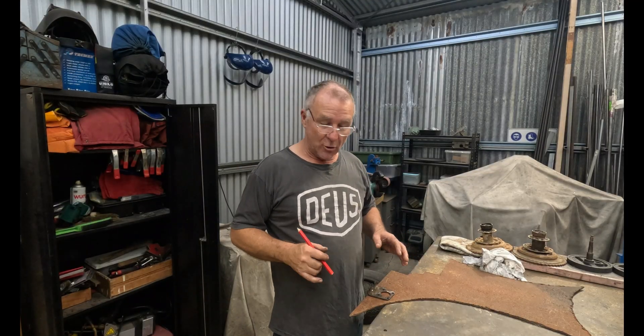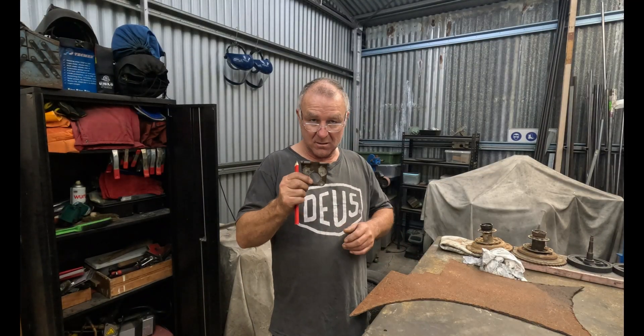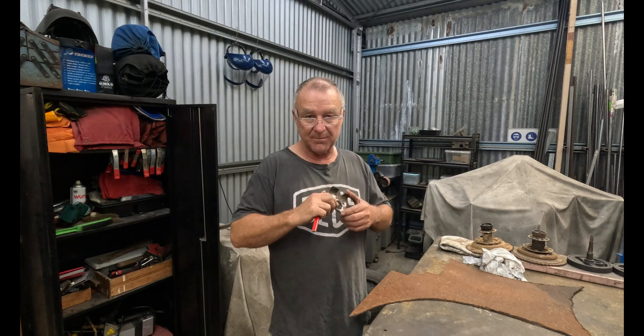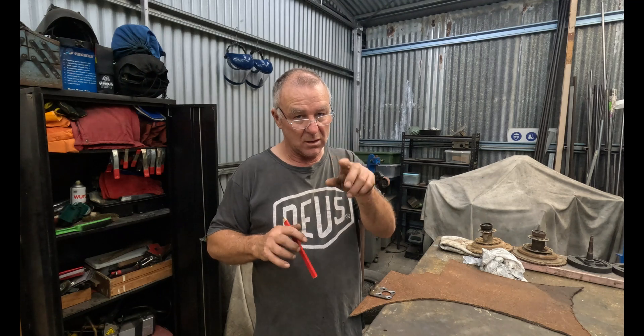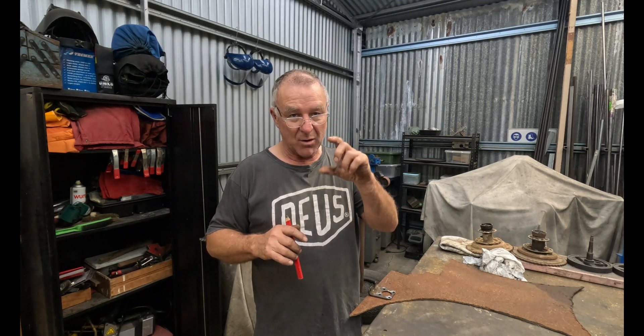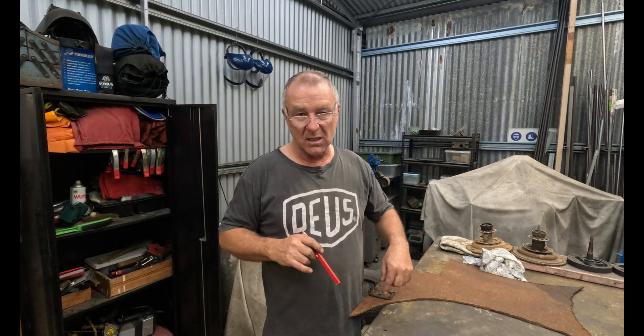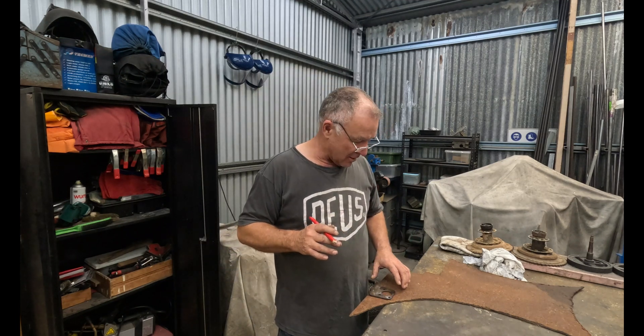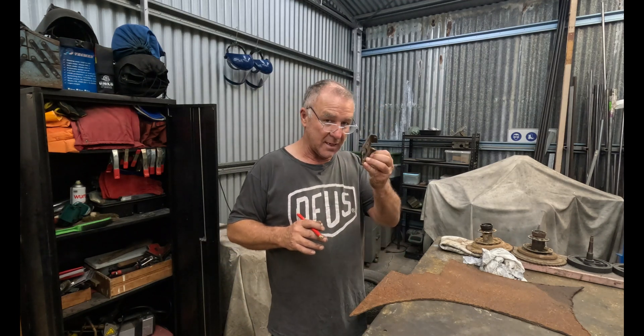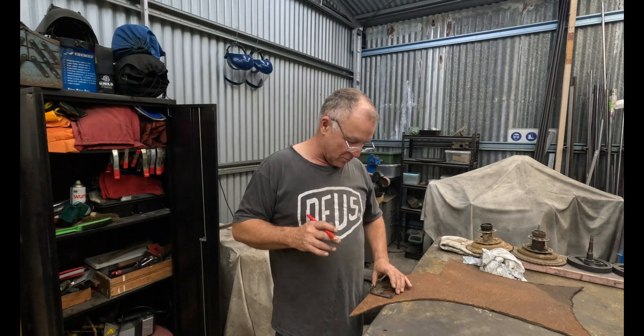How I'm going to go about this: I'm actually going to cut out another piece like this, and I will leave a bit overhanging at the back. Then I'm going to go and machine up the two bosses and bolt them up to the fork leg, get everything lined up position-wise, and then cut out and dress the last of this plate off. Luckily enough, I've got a bit of plate the same thickness as that, which is what I think I'll need.